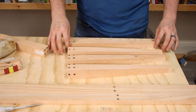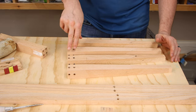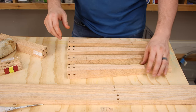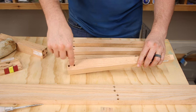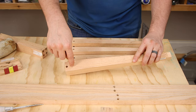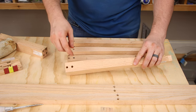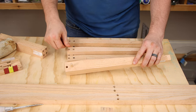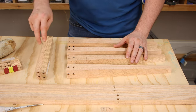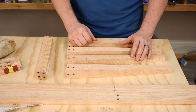It's time to glue the dowels in. I've got the legs sitting the same way because I'm only going to glue in two dowels at a time, let them dry, and then drill out the hole again since the dowels overlap. There'll still be plenty of dowel left in there, but we need to do that to allow for putting the next dowel in. We'll glue dowels into the supports and the legs and then we'll be ready to assemble the whole base.